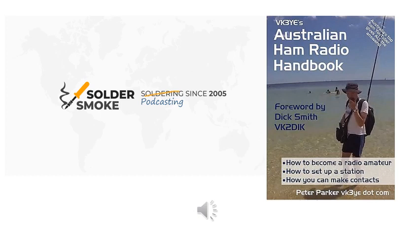That tiny QRP rig in a ballpoint pen might look cute, but it's strictly a write-off. Instead, you need to go back to radio fundamentals. You've got to put a signal in a distant receiver strong enough to overcome a certain path loss. That all gets into propagation theory, output power, antennas, the noise at the other end, even how good the other guy's receiver is and their operating skills.